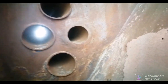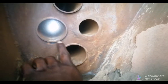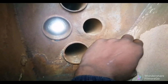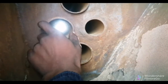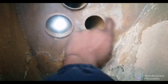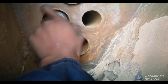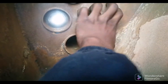So on our tubes here, we have these common tubes, and these ones welded here are the stay tubes. When we are doing our maintenance, we change the common tubes and we leave these stay tubes. The stay tubes last for a lifetime, because number one, they are a bit thick compared to the common tubes, and these ones are welded in to our back plates.